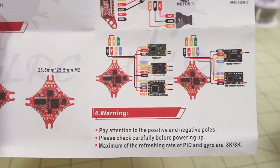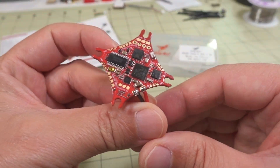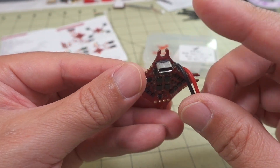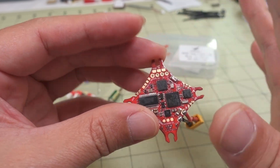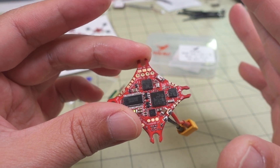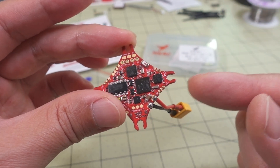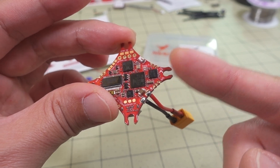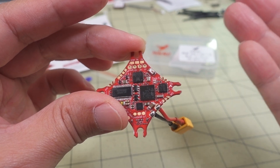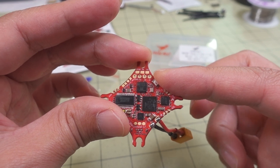I want to get right to how the Wi-Fi works. It does not power up over the USB port — it is on UART 1. This board is specially configured from the factory. If you reflash this with just the F411 target, it will wipe out the settings. You have to go back to the product page and get those back. Basically, there are some special settings that enable the Wi-Fi radio, so if you reflash and do a complete wipe, you're going to have to put those settings back in to re-enable the Wi-Fi radio, because it's on UART 1.